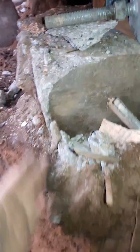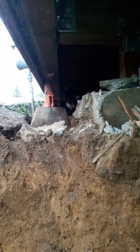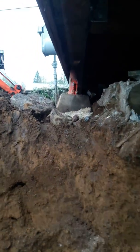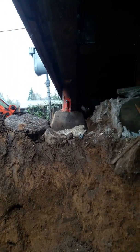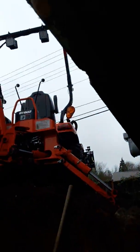The question I have is: how do I carry this outer wall of the house? Right now it's resting on these jacks, and these pads are going to be in the way when I mine all this out to put in the foundation — that's going to go away unfortunately. The thought is I could take one of those pier blocks and basically just post up every few feet. Could I just leave that pier block and that post there, form up in between, and pour? I'm not sure I could carry this outward anyway.